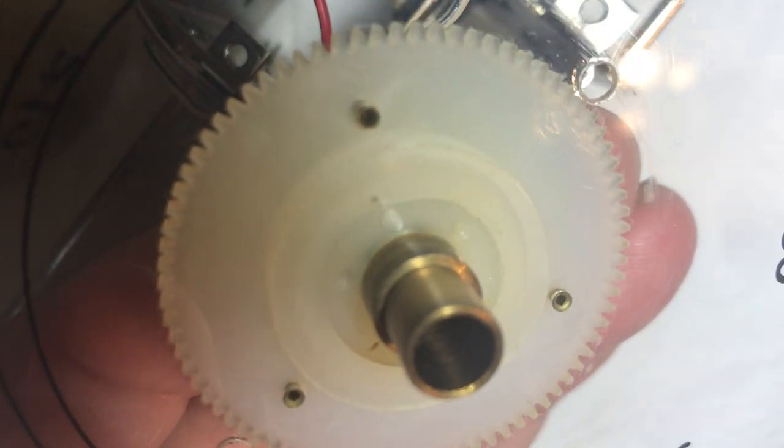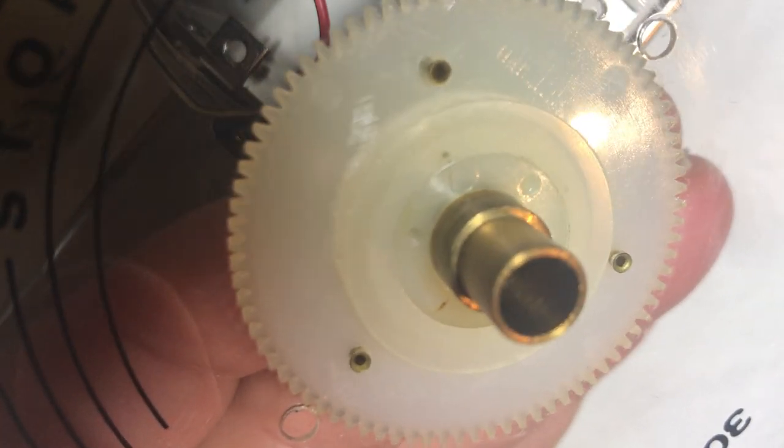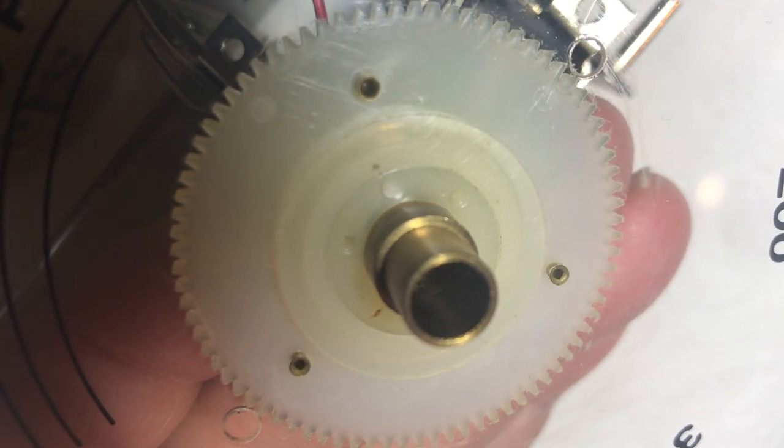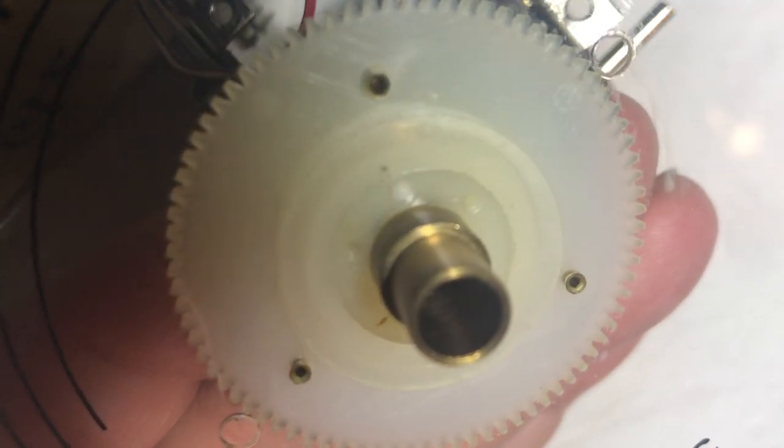I'm not having a lot of success here. That seems to be on there — it doesn't go on as aggressively as the other PTO I fixed. Now it doesn't matter if these wheels are lined up — you simply want to get the PTO locked on here with the little locking tabs. As I said, these are small and they can be lost. Oh, there they are. This part is where you can really screw up and drop the stuff and lose it, so don't do that.